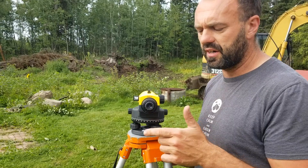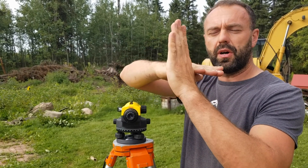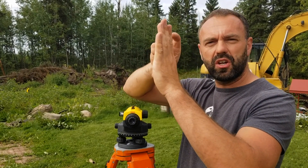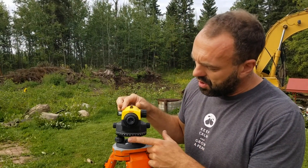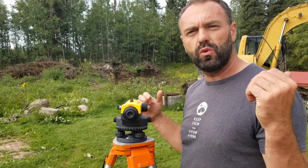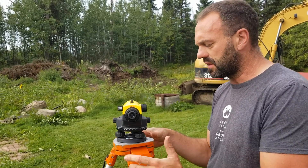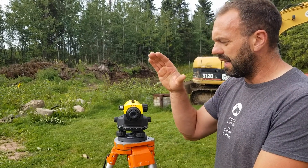Inside the lens there are a couple of cross hairs — a vertical cross hair and three horizontal cross hairs. The center one is your elevation, and the top and bottom stadia lines are horizontal lines going through the vertical cross hair. If you take the top cross hair reading and subtract the bottom cross hair reading, you can get the distance from this transit to the staff. So if you know your declination relative to north, the distance from the transit, and the elevation, you can determine any point on earth with this little device. I like them because they're waterproof, they don't take batteries, and they're fairly inexpensive — about $300 for the whole rig. I use this thing all the time on my property to figure out levels and slopes.